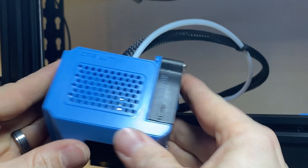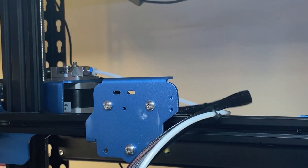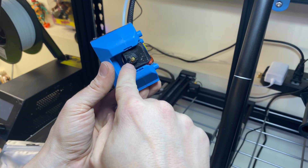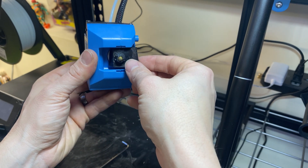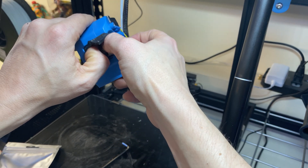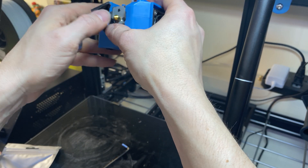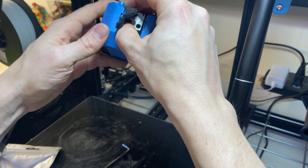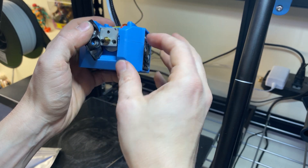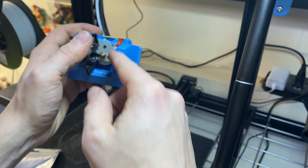Now this is free and you can see underneath here there is my nozzle. This is your hot end, and underneath here you have your nozzle. You should have a plastic or rubbery coating on there — it should just peel off, and it might stick a little, so you definitely want to make sure you don't rip or tear it because this one's already ripped a little bit. You don't have to take this off completely if you don't want to — you can just leave it on and wrap it back on. I'm actually going to leave it on and just fold it back.